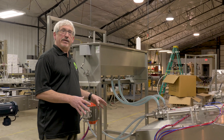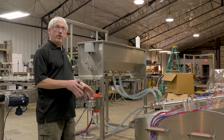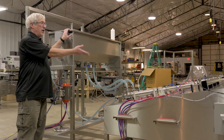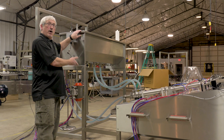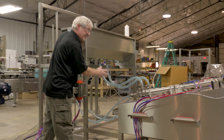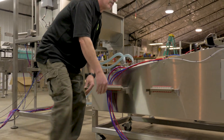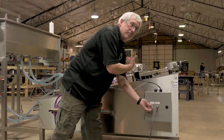If you're curious about how easy and quick it is to change this machine over — to get the dock removed and then in and out — think about the three factors that are most important: your fluids, your pneumatic, and your controls, your electronics. So when you're done with the production cycle and you want to switch from the 1000 ml product barrel to the 60 ml product barrel, you simply run your reservoir dry, get all the product left in there out, run your fill heads so they're empty, and then come right over to your pneumatic bank. There are just a couple of screws with an Allen wrench — you drop that out — and then you come over and turn these collars on your electronic hookups, and your system is completely detached.